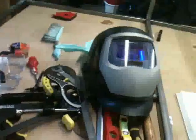Next to do on the build is basically the back frame — the SB frames going at the back, and a crossbar. I was toying with the idea of sticking round tube in to give a nice smooth edge, but it'll just be trouble. So what I've decided is to put normal box section down here and then get a half tube and put it over the top to give it a nice edge. I can also install poppers on the back so I can pop on door panels if I want — that'd be quite nice.